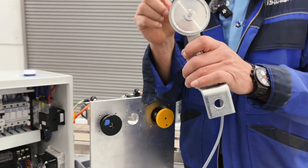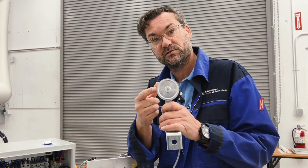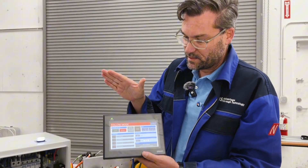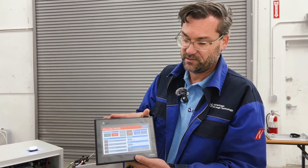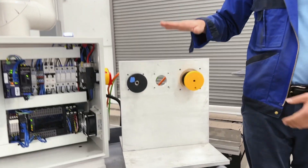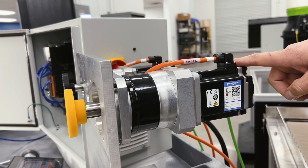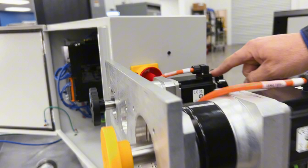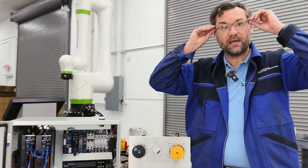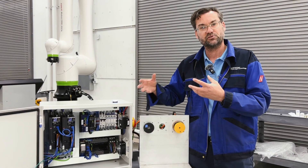Each electronic gear has an external encoder. In this case we have a surface-mount encoder with a 200-millimeter circumference wheel. To control the system we have an Omron touch screen. We will deliver the system just as you see it here, and the customer can mount the HMI wherever they'd like. The two motors that correspond to the drives are an 800-watt motor with a 10-to-1 inline gear head and a 400-watt motor with a 10-to-1 inline gear head — that was a customer request for their mechanical system.